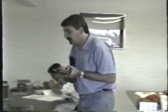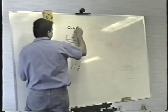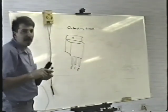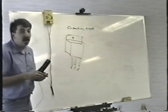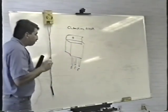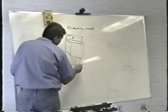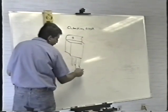All right. Now, here's what these guys are for. These are called the clamping diodes. They are protection diodes. They're there to protect the transistor. Without clamping diodes, those transistors would blow right out. And I don't want to get into it in any more detail than that. It's not important to know any more detail than that. Now, where they're connected in the circuit is here. Each transistor has a clamping diode, and it's connected right between the collector and the emitter.